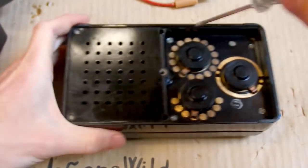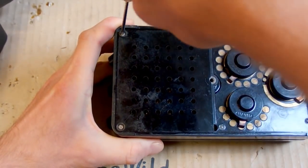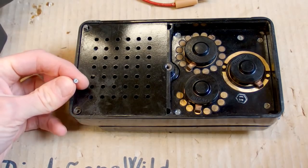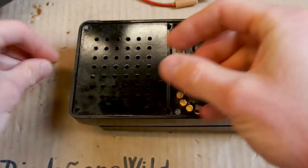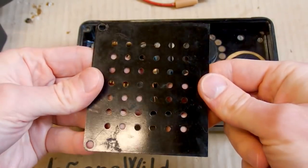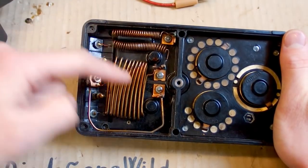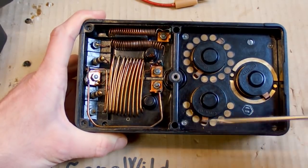It doesn't work, so let's take a look inside and maybe fix it. It's old so the screws are slotted screws for a flathead screwdriver — which I like. There are some very old screws with strange washers and a cover made of very strange, thin but non-conductive material. And here you can see some shunts — those are probably the current shunts for the current meter, working as low resistance high power resistors.